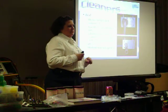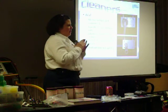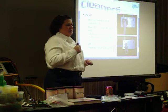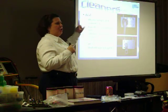Aluminum has oxides on it. We talked about that earlier. I can remove that oxide with an alkaline cleaner, or I can remove it with an acid cleaner — either one. But I need to remove it, especially for a super durable or fluoropolymer coating.